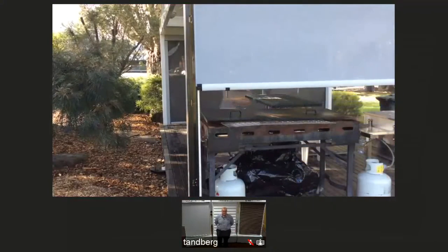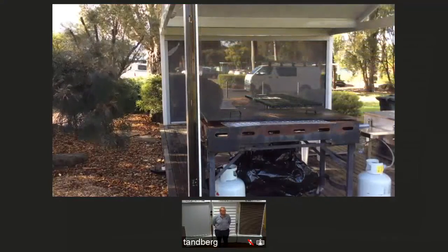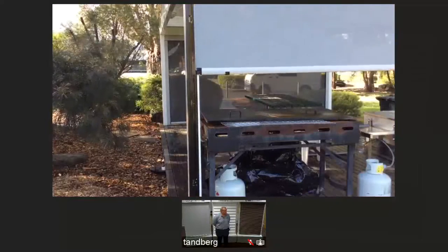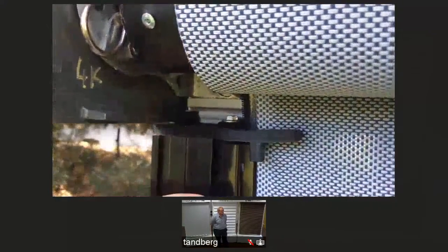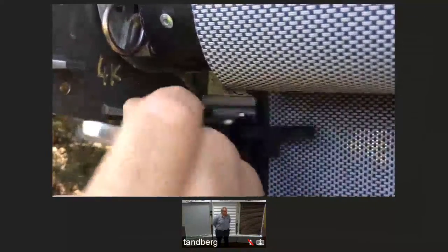Cycle the skin down and up two times so that the floating guide finds its true position. Leaving the skin in the down position, adjust the top alignment cap. This keeps the floating guide at the top in the correct position as determined when the skin was run down and up. Tighten to secure in the desired position.